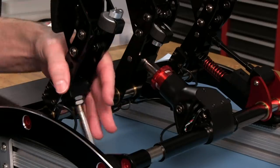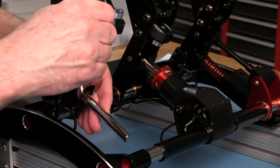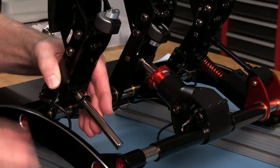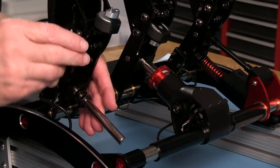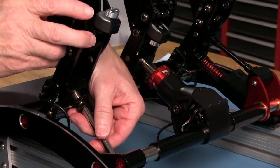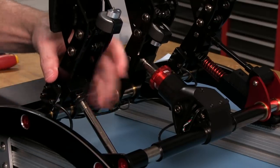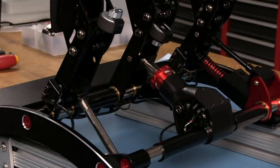Just a quick bit here to show you how to adjust the throttle pedal's throw by adjusting the length of this rod. These are 17mm nuts - you've got to loosen those. Sometimes they both turn at the same time when you loosen one. Once you have those loose, it's a simple matter of turning the rod in or out of the block that attaches to the pedal lever. There I'm making an adjustment. Just roll the nuts back up, give them a good tighten, or test fit before your final tighten. That's an easy way to adjust the throttle throw - it's just not documented in the PDF manual from Fanatec.